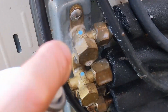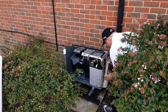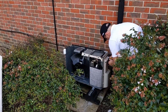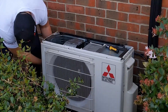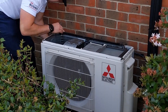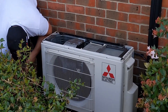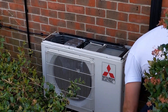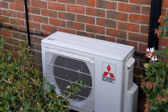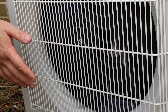Checking the actual joints — I'll get some leak detection spray for that. Once you're happy with all that, start putting the covers back together. Put the covers back on, put some power back onto the unit, and then test operation to make sure it's all working fine.